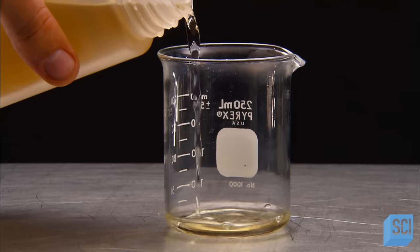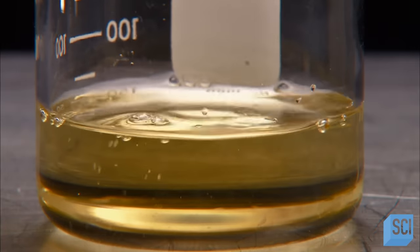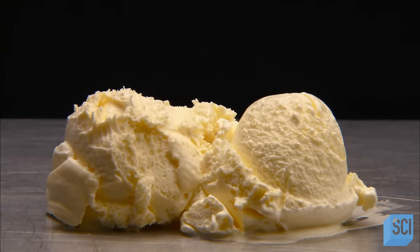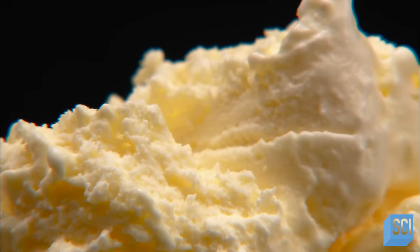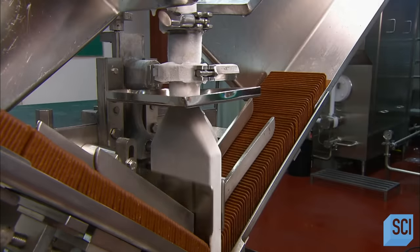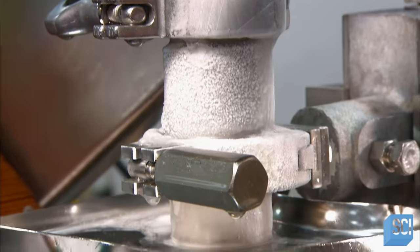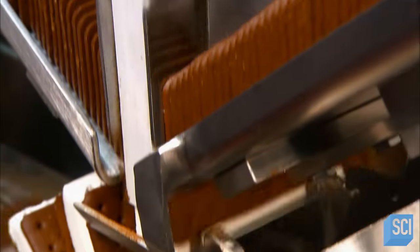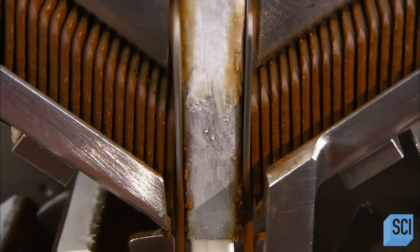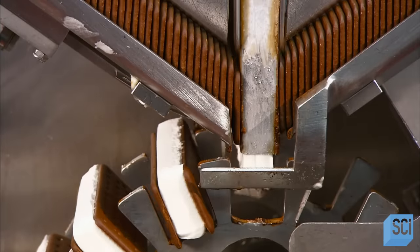The mixture is cooled and concentrated vanilla flavoring is added. Then the concoction is chilled and whipped for about 15 seconds. Whipping blends the mix with air, transforming it from a liquid to a soft solid — without air, the finished product would come out looking like frozen milk rather than ice cream. The ice cream sandwich wafers are made of chocolate cake ingredients. A filling machine feeds two lines of wafers toward an injection pipe. Just as two wafers come together, the machine injects a third of a cup of vanilla ice cream in between, and the pipe's head shapes it into a rectangular slab that fits perfectly between the wafers.